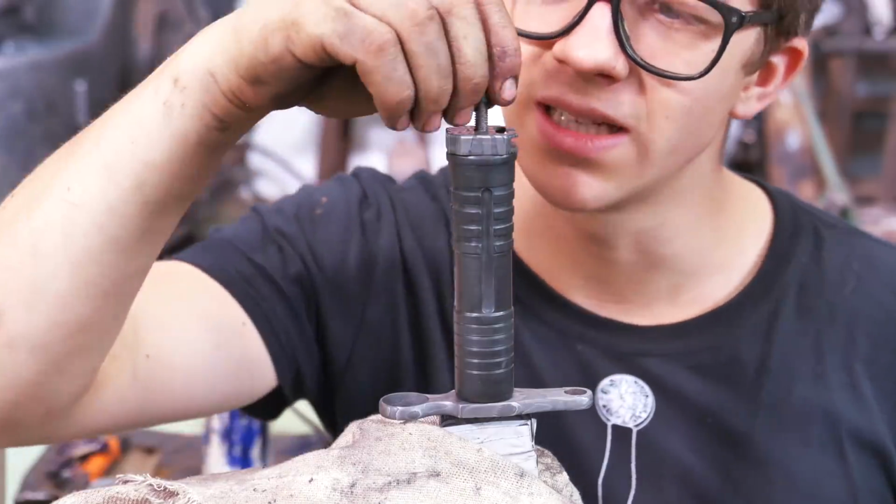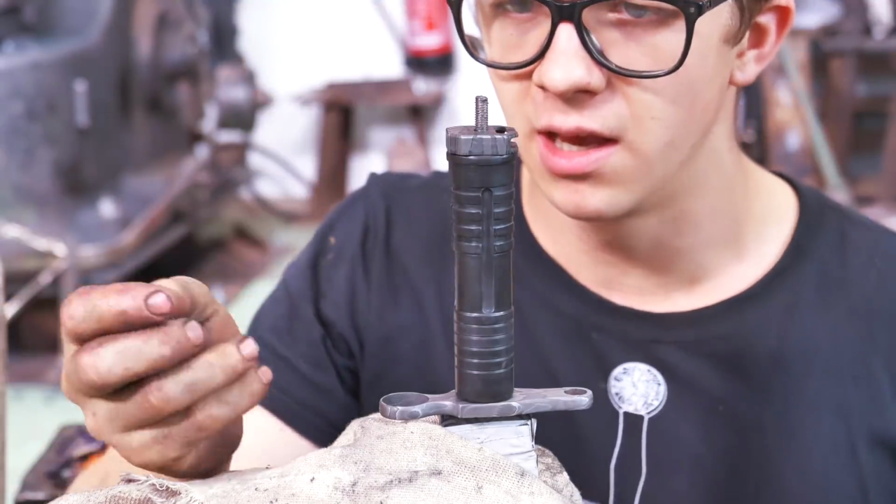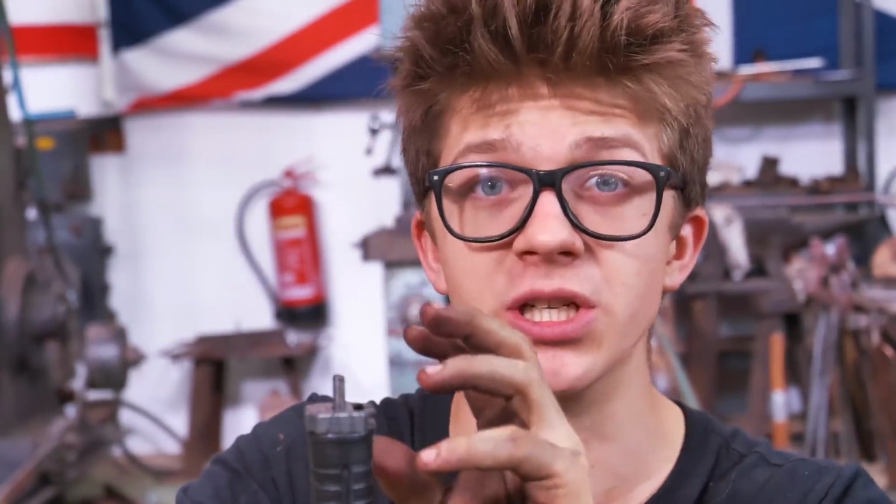So now all I need to do is cut off just a little bit of that tang there, about 1/2 inch of the tang, and then it's on to gluing everything up. Now Delrin itself doesn't actually take to glue very well, so really all the glue is going to be doing with the Delrin is just filling up all the gaps between the steel and the Delrin. It's a wonderfully tight fit now already, but by filling up the gaps and then relying on the tension that we're going to be putting on it with the screw and then the glue everywhere else, I think this is going to help this be a nice kind of rigid construction.